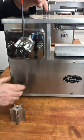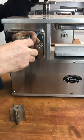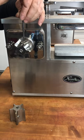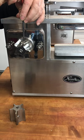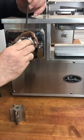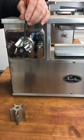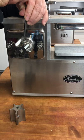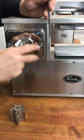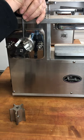I'm going to tighten this just a tiny little bit. It's not easy because of that staking. I felt it turned a little bit, and now I can feel it's actually harder to get off. So I'm going to turn it just a tiny bit more — and you can't really even see me moving this screw, yet all of a sudden it's getting quite a bit tighter. So now let's go the other way. The amount of adjustment required is minute. And it just loosened up — this is really what we're trying to do: turn these set screws a minuscule amount.